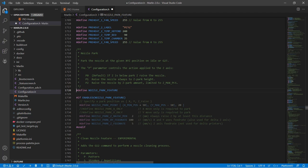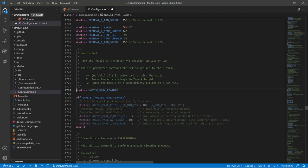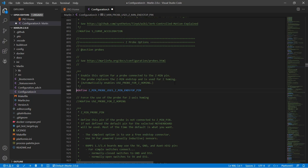We will now enable the 3D Touch. This time it's a little different — instead of using the Z-min endstop, we will use the 5-pin probe to connect the sensor. Search for Z-min Probe Use Z-min Endstop's Pin and disable this line, as we are no longer using the Z-min connector for the sensor. We will use probe for Z-homing instead, so enable that line. The rest of the settings are pretty much the same as connecting the sensor to the Z-min connector.